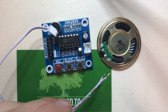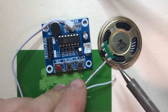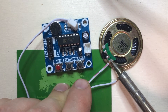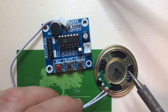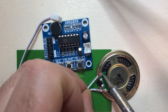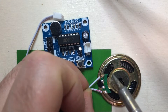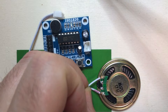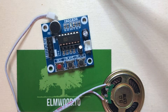First things first, you got to solder everything together. The wire with the long stripes is gonna be your positive wire, so we're just gonna put that right here. Then the negative wire just has very faint little dots on it. You can see on the speaker that it's got the polarities marked on it — there's a negative there and a plus there. That's not the prettiest soldering job in the world but it'll work for now.